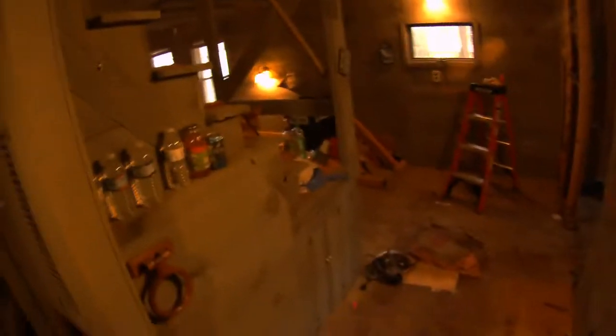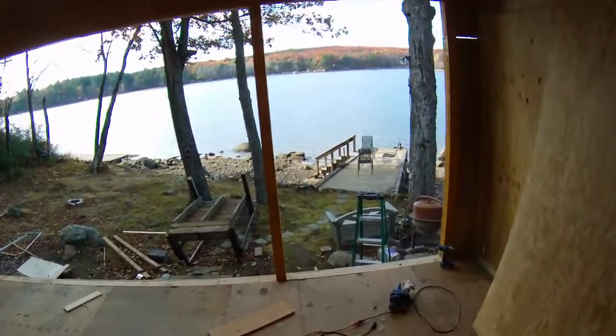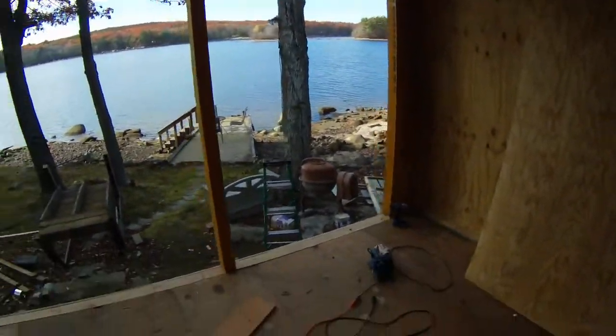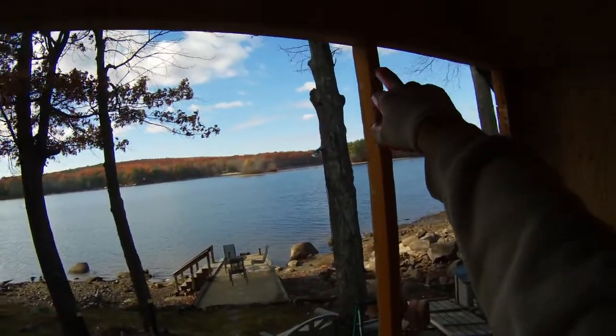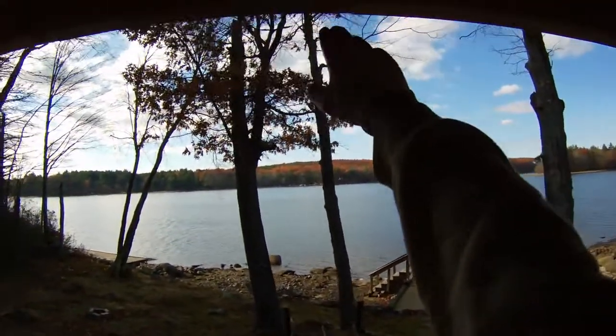The kitchen is totally out. We've taken out the toilet and will be taking out the vanity as well, and we'll be taking the stairs out soon. The heating is pretty much done. This is pretty much the rough opening size — I added some shims up here to get it to exactly eight feet. It was eight feet one inch over there, so I added about an inch of shims coming down to about half an inch and then almost zero at the bottom.